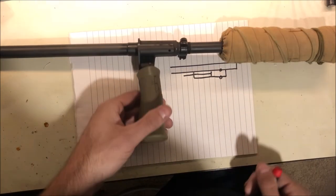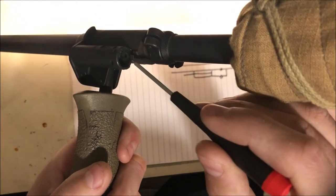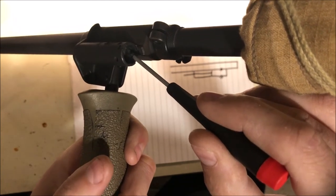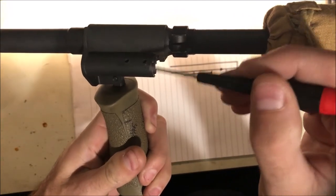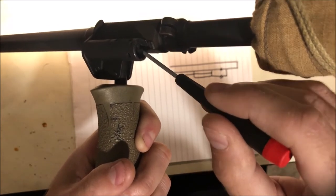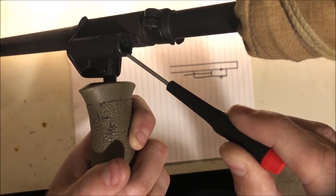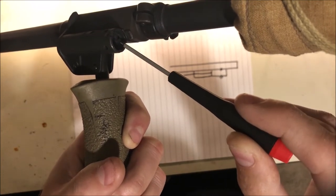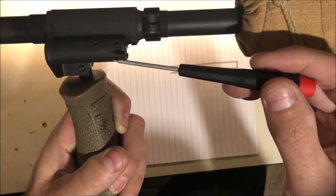In front of me here is a standard AUG barrel. You can see the barrel itself, and coming from the barrel is an inlet hole into the gas chamber. What's also important to notice is that aside from the inlet hole, you also have several vent holes on the gas plug. That means you can control the amount of gas acting on the piston not only by adjusting the amount of gas allowed into the gas chamber through the gas plug, but also by how much of that gas is allowed to vent out before it acts upon the piston.